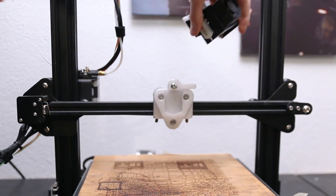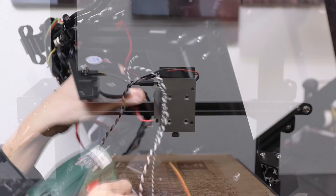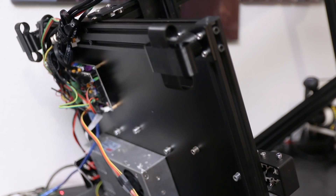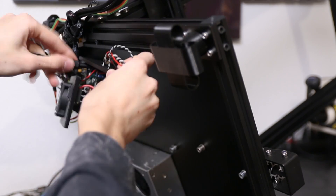Other than mounting, you just connect 2 wires to your controller board to some kind of PWM signal. One way that doesn't even require firmware modification is to use the header for your part cooling fan. You connect it to the fan header and use M106 and M107 to turn it on and off, and you can add an S command behind M106 for PWM modulation to set it to any brightness. You can also hook it up to a dedicated pin and use laser integration in your firmware, like the smoothie board's laser mode, which may give slightly better performance.